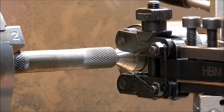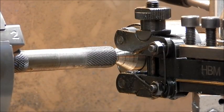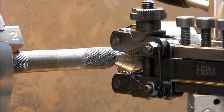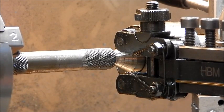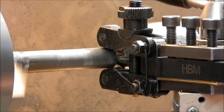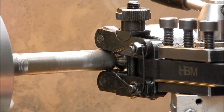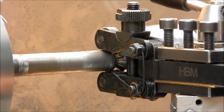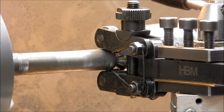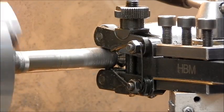So we'll come in again a little bit. We'll re-engage it, go down some more, and it will catch on the original knurl pattern. There we go — tighter position again. Put it on the feed again, and then we'll feed it across with a little bit more load this time.